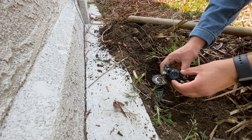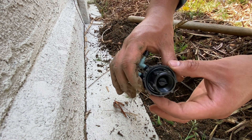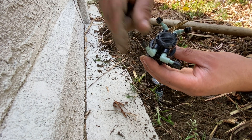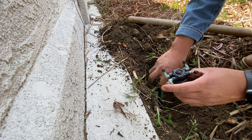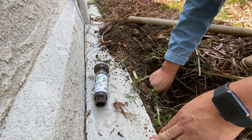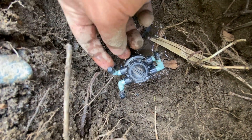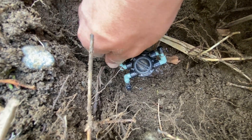Over here, this is going to be the attachment that I'll be using. It's a half-inch threaded pipe that I'll be replacing the sprinkler head with. It's going to allow me to put in some quarter-inch emitters that I'll be reallocating over to a tree — four of them. So what you're going to do here is lefty-loosey, remove this out. There's some water and we're just going to tighten it up — righty-tighty. Every single cap here will allow me to take off this little end cap, and you'll be getting a quarter-inch emitter going to a tree.